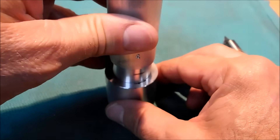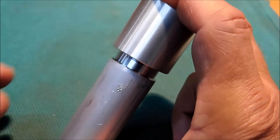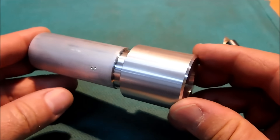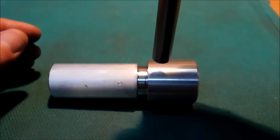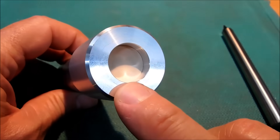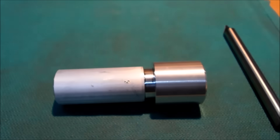And now the arbor itself. We need to crush this together and get this together somehow. I'm going to do that on the mill - squeeze it in the vise this way. I'm going to pin it right through the cap. No threads necessary. Let's set it up in the vise, move the camera, pin it, see what we get.